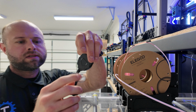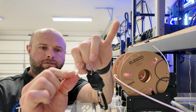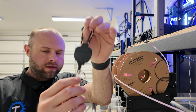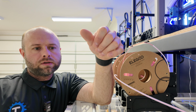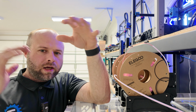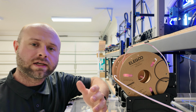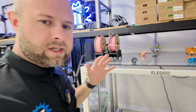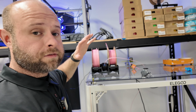The only real problem with that is that it is quite a lot of tension, and I'd have to hard affix it to the Bowden tube because it's just going to slide through this. If I'm doing that, there's a potential for it pulling the Bowden tube out of the print head and also jamming it up near the top. So I'd have to keep an eye on things either way for really huge prints, which take so long that it's going to be happenstance that I come in here and am able to fix things. Additionally, I think the long Bowden tube is giving a lot of friction.